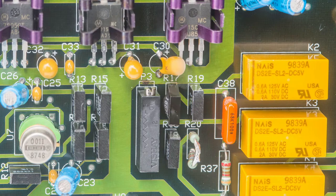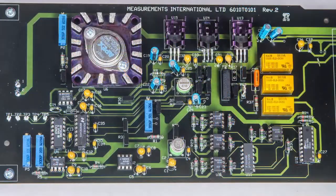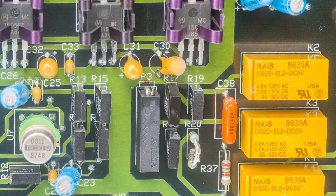So I thought, oh, maybe some tantalum capacitor is blown up, because you can see quite a lot of them, all around the opamps, those yellow bits, those are tantalum capacitors, and in many of the older equipment, such as Datron calibrators, Wavetech multimeters, Fluke calibrators as well, they tend to catch fire and also have some spectacular smokes released. So the first idea was to check all the tantalums, but that was just before I found this blown up precision resistor in there.